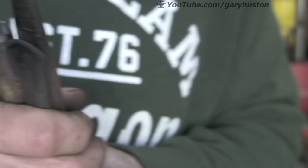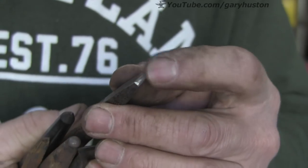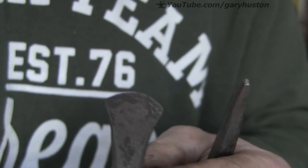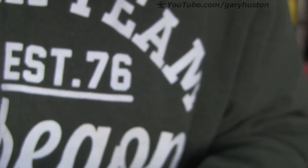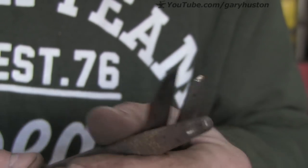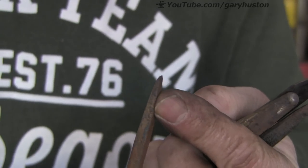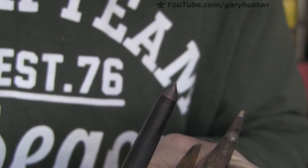The tools we're going to need - nothing too fancy: a flat-ended sort of punch with a rounded corner so there's no sharp edges, that's for sculpting; a thin chisel; a round-ended punch for the eyes; this tiny little chisel I made specifically for this job out of a bit of spring steel, made that for doing the teeth; and finally, a good old centre punch.